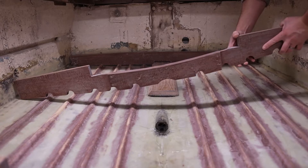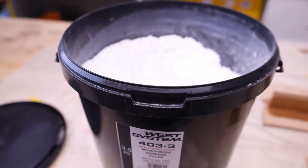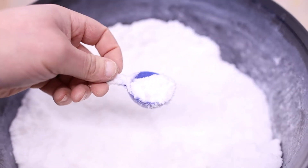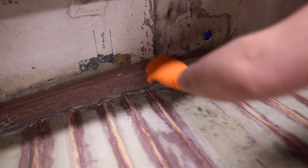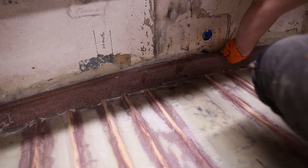Once that was done with all of the frames and stringers, I'm ready to start putting them into the boat. I started with the transom bow, using the West System microfibres additive to thicken the epoxy for bonding all these frames in. It's got quite good gap-filling properties and also fillets fairly well, so we're bonding all the frames in with that and then filleting the corners — which brings me nicely on to showing you a new tool I've found for doing epoxy fillets.